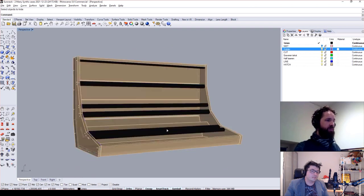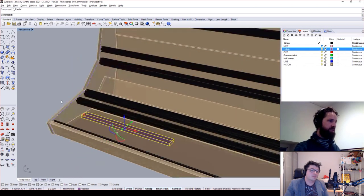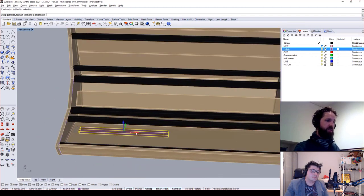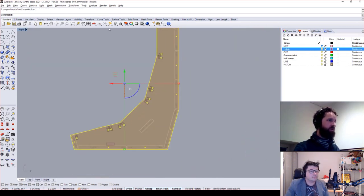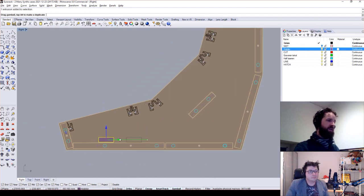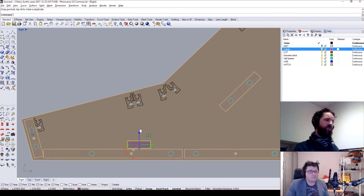And then we go to busboards. I work with busboards from Modular Synth Lab, Robert. Polish guy who lives in the Netherlands. So this is the size of his busboards. What I mostly do, if you look at the side view, let's hide this one for a sec. If this is the busboard, I mostly don't place them here, because then your deeper modules might have a problem there. So I place them mostly underneath the rails.